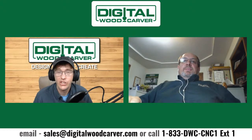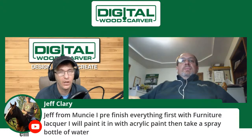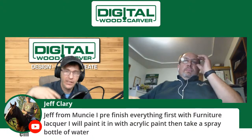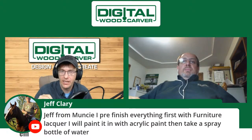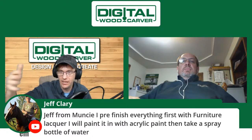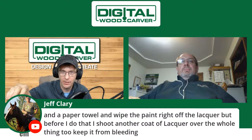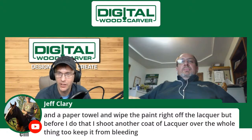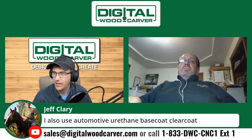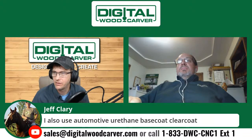Yeah, exactly. Now, Jeff Cleary has three short comments, a little tip on what he does. He finishes everything with a furniture lacquer. He'll paint it in with acrylic paint after the pre-finish, and then take a spray bottle of water and a paper towel and wipe the paint right off the lacquer. But before he does, he'll shoot another coat of lacquer over the whole thing to keep it from bleeding. That's interesting. He uses an automotive urethane base coat and clear coat. Thanks for sharing that with us, Jeff.